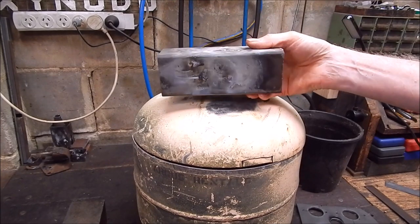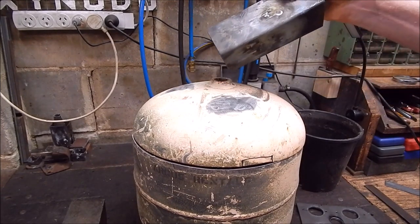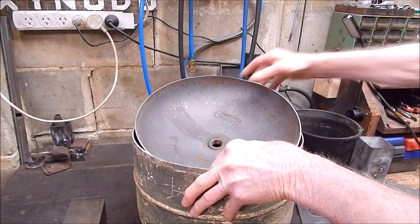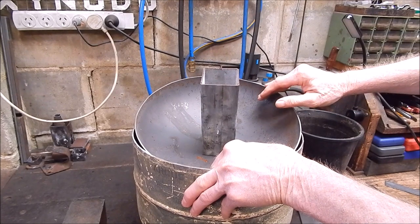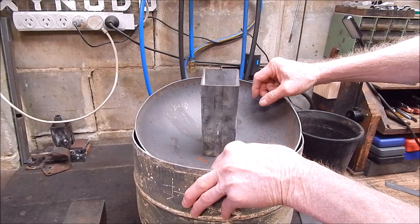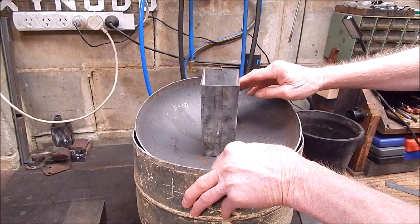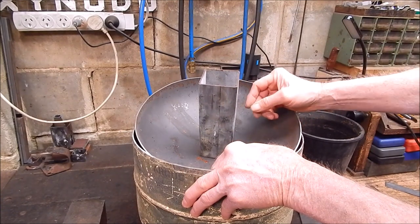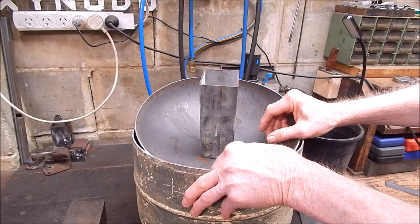I'll use the vent for brazing — it's a brazing rest and reduces heat loss. I've got some more of this square section somewhere, so I'll salvage a bit for the lid. Then, once I've done that, I'll weld some mesh from the centre bit to the rim all the way around — some reasonable mesh thickness — and that will hold the insulation in place so it can't drop out. There'll be support for it. Just some square section mesh, pig mesh or something like that, whatever's lying around. I might have to get some from the farm.